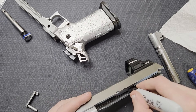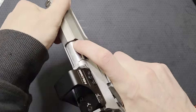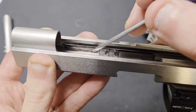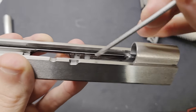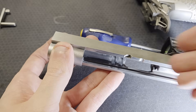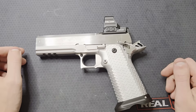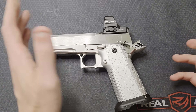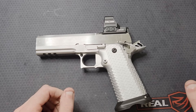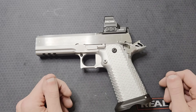Since material needs to come off the slide, I'm going to put Sharpie on the slide. I can see I have a line of contact right here, and then another line of contact right there. Make a little adjustment, clean thoroughly, reapply Sharpie, recheck, repeat. That took a long time — not because a ton of material needed to come off, but because I was going very slow and taking a tiny bit off each pass. After I was happy with the clearance, I addressed and polished the whole slide barrel passage. I have decided to leave the number 3 link in there.